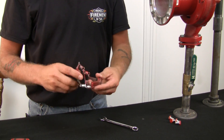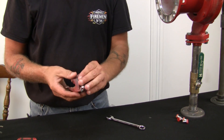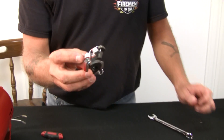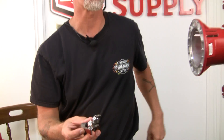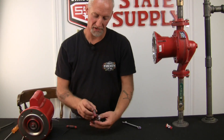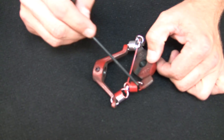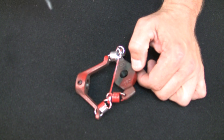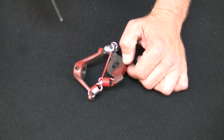Seeing how we're going to change the coupler and motor mounts — I'm cheating because I'm using a new pump. On your old coupler, if it's whole, save it for emergency purposes. But you can inspect it at this time. If there are any grooves or openings in the holes where the springs go through, keep it — but I suggest that you change it.